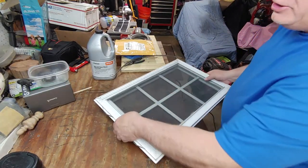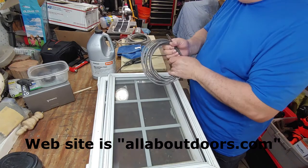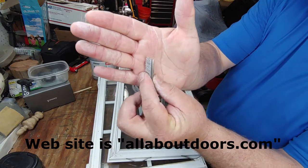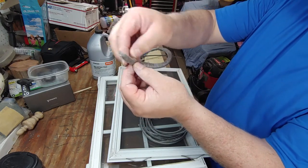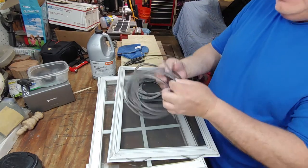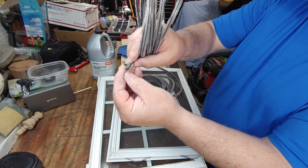I'm going to show you how to replace this. The product I got — it's not a sponsorship, I just found it online and you can order the lengths that you need. I bought two different lengths. I pulled one of these pieces out to see what the base is. You can see the base is three-sixteenths and this is a half-inch pile, and it has a plastic little rain drip built into it. The other one has the same three-sixteenths base but a quarter-inch pile, and it too has the little plastic rain shield built into it.